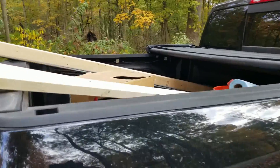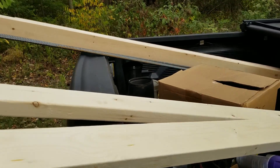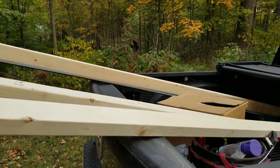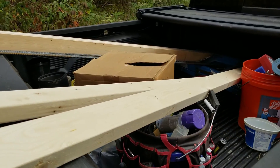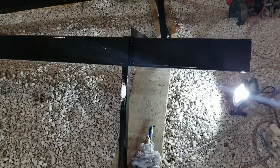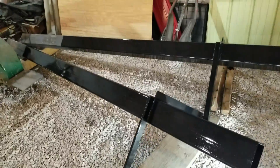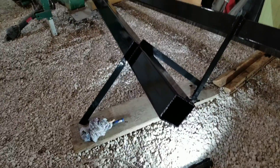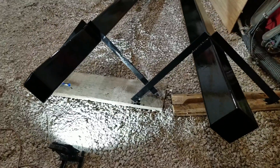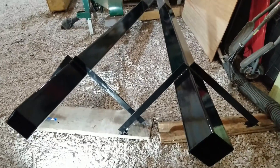Grab my coffee and walk up to the barn to see what Chris is doing. Went to Home Depot, got some more materials. Had some stuff laying around but just needed a few more items. My truck always looks like I'm a general contractor — I'm actually not. So there are the posts we had made, had them custom fabricated for us. They're 6x6, 12-foot-long posts and they had these pieces of angle iron welded to them. Chris just painted them black with oil-based paint so we can avoid corrosion when we set them down in the hole. 12-foot, 6x6, which will support those big boys.